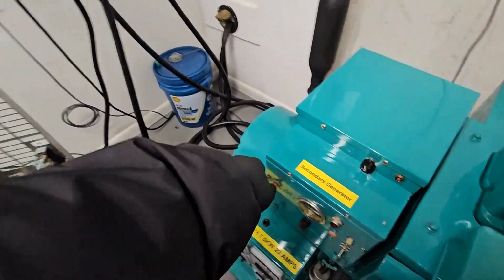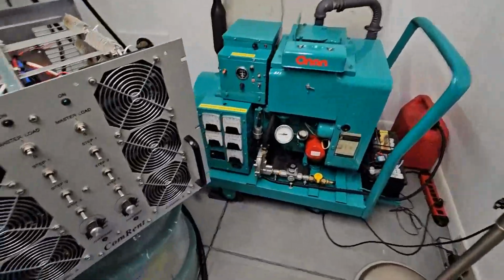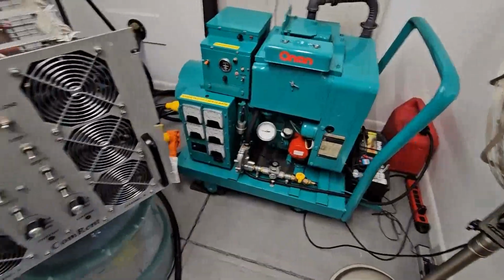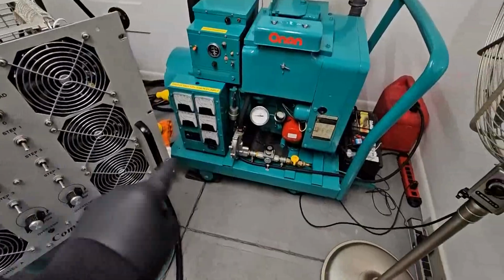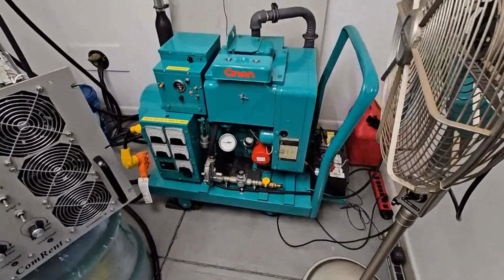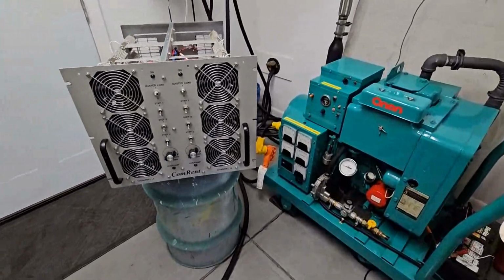All right. Hopefully you could hear me when I was talking. The DJC, or excuse me, the JB is not as loud as the diesel motor. As you saw, we brought this thing down to its knees, which I expected, because this thing has a capability of 11 kilowatts of load, whereas this thing is rated at 7.5. We got well above it, so this thing here is healthy, but nonetheless, everything's working out good.